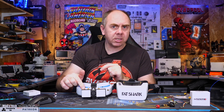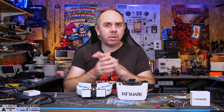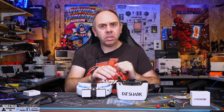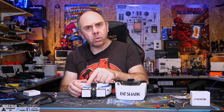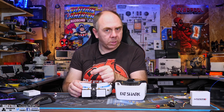There is a hidden switch located on the back of the VRX module or the top of the Scout HDs, and this allows you to put it into recovery mode to get the system back up and running again. On the Scout HDs normal mode is with the switch at the back and recovery mode at the front, and on the goggles module recovery mode is with the switch down and normal operation with the switch up.